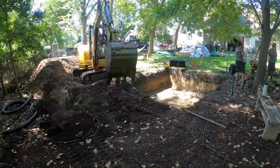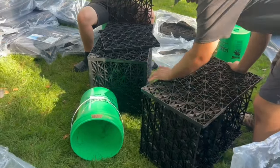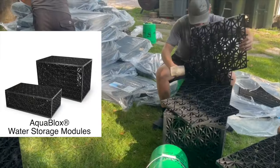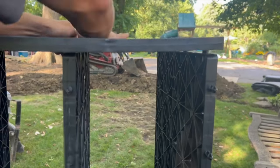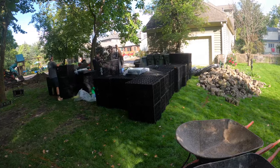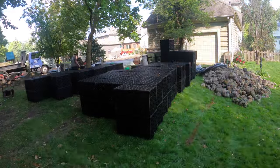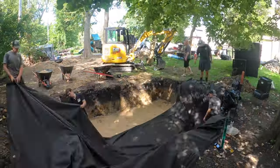While I'm digging, the guys are keeping busy by putting together aqua blocks — that's going to be about 100 aqua blocks. You can also see that we've double-stacked them. What's neat about these aqua blocks is if we don't have the footprint to go left or right, we can go down with them. We can actually stack these things up to four high and still structurally be able to put whatever we want on top. In fact, on this one, we're putting a patio right back over the top of them. We're stacking these two high just because we didn't have the real estate to go as wide as we wanted.